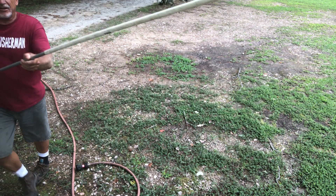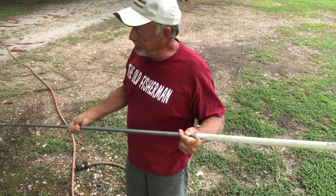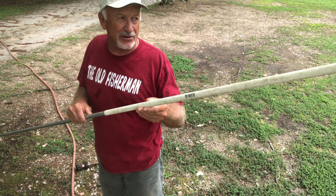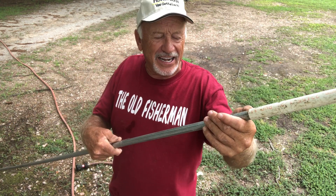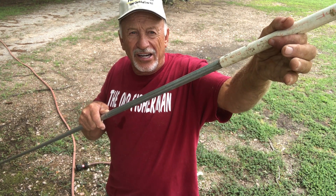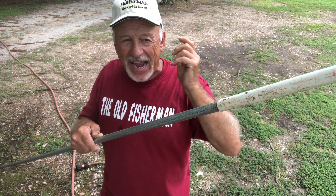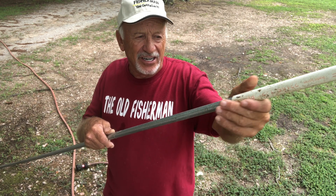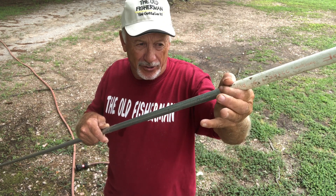You take a 10-foot stick of electrical metallic tubing. On the end, you buy some CPVC and you cut it in half. You can buy five sticks of CPVC and cut it in half — that'll give you 10 pieces. The thin wall will slide over the top of this electrical half-inch metallic tubing and then you glue it. To back that glue up, you can wrap some duct tape around it also. Sometimes when you pull them out of the mud, that glue will give loose and you pull the top of your pipes off. So you want to glue it and probably tape it to give you a backup.